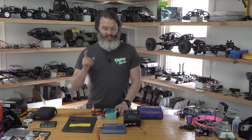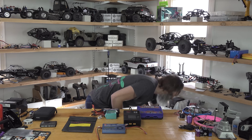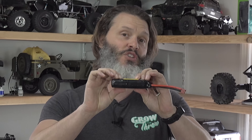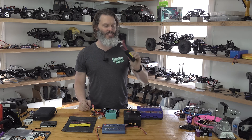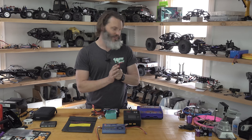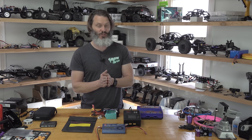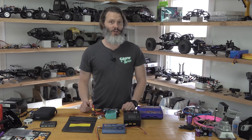It is dangerous to charge these. Even more dangerous is charging a worn out or a puffy pack. I've got a puffy pack right here — it's not something I should be charging anymore. That's your big indicator. When it puffs, that means the organic solvent has actually come out from between the anode and cathode and is free inside the cell. When there are dry spots, you can get short circuits or heat buildup from high resistance areas.